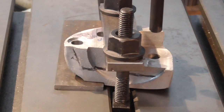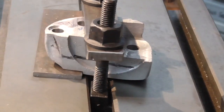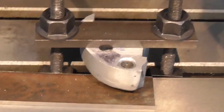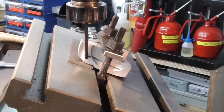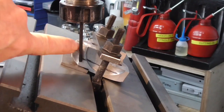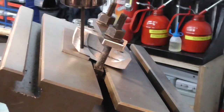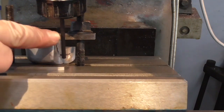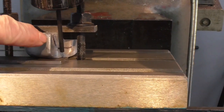So now from the back we're aligned with that hole as well and I'll just recheck that alignment there. That's how we're looking from above. Now with the angle plate tilted, I can use another guide pin to follow the line drawn on the outside and get a depth of where I need to be for the drilling. Although I've moved over, I've got a zero set on the DRO to come back into the centre of that hole again. So I'll change over to the drill bit and we're almost ready for the first drill way.